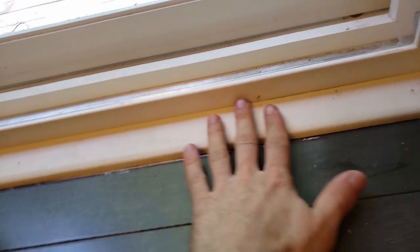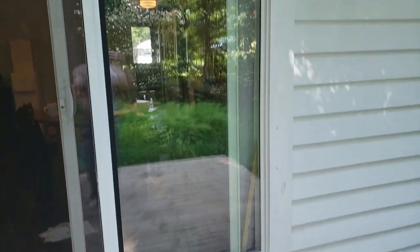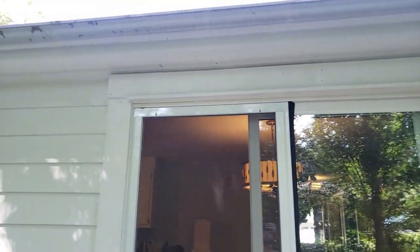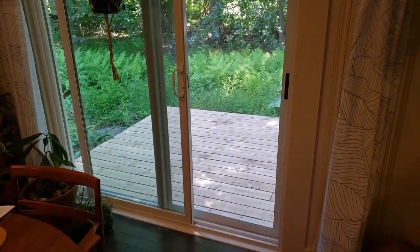The rest is kind of an art form. Putting trim around the frame and hiding all those exposed studs is probably one of the least easy parts here, because you have to actually make it look good. But other than that, make sure everything on the outside is caulked, the screen gets installed in a similar fashion to the door, and enjoy what is probably one of the single most incredible upgrades to your home there can be. The house instantly gets brighter, you see the nature in your backyard, and you have a means to get there.